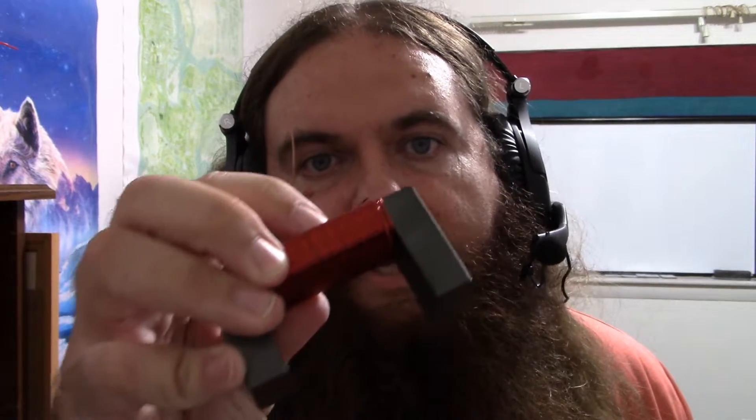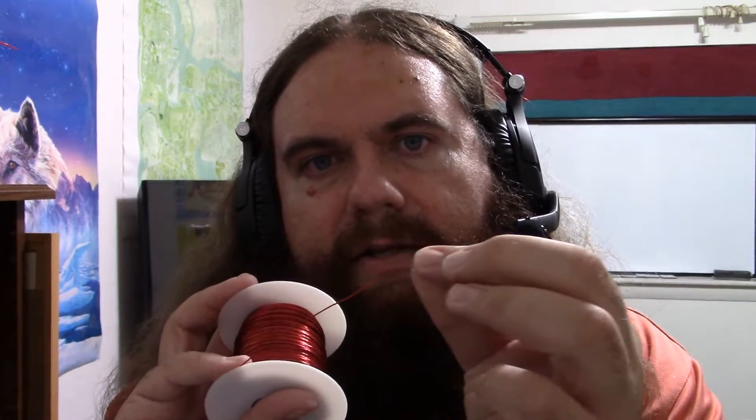What kind of wire do you use? This funky red wire I have, and then over here I have it covered in electrical tape. You use something called magnet wire — I'll give you one good guess why it got its name. It's all about distance. We want to have the coil of wire packed as tightly as possible, as thinly as possible, because inverse square — the further apart these are, the weaker everything is. So if we can pack them in real tight, we'll get a stronger electromagnet. This is insulated wire — it's a conductor, and it is insulated, but not with rubber or latex. It's lacquered. There is a very, very thin layer of lacquer on the wire — just enough to make sure that it doesn't conduct to itself, that it doesn't short out. And no more. So you can pack them in as tightly as possible.